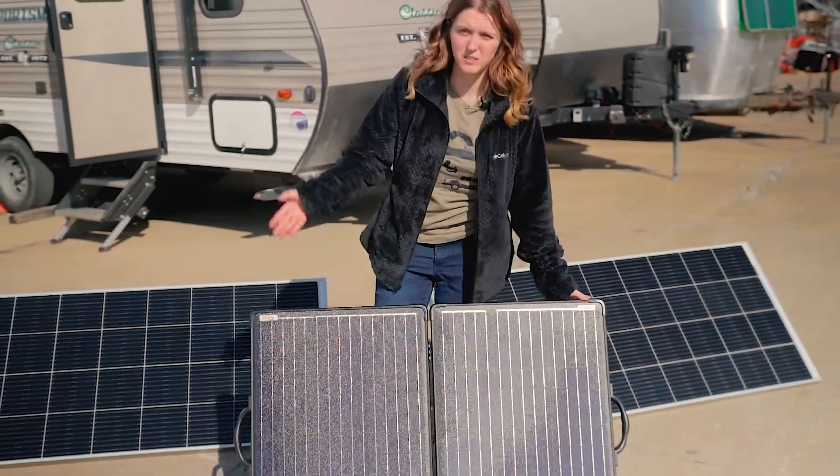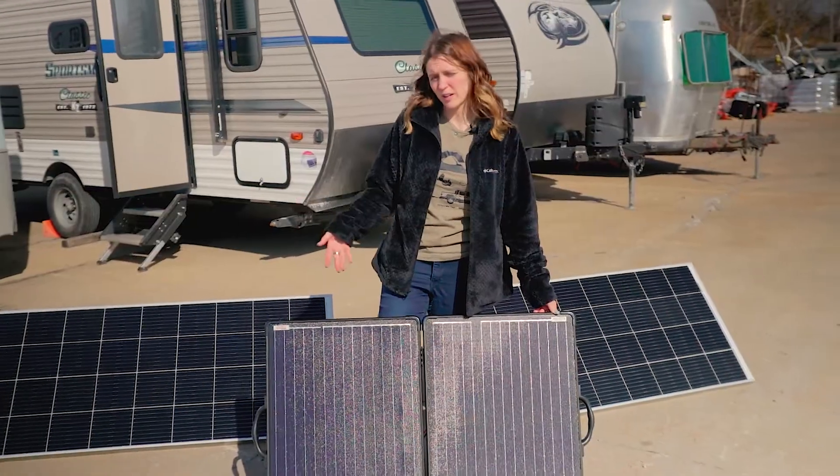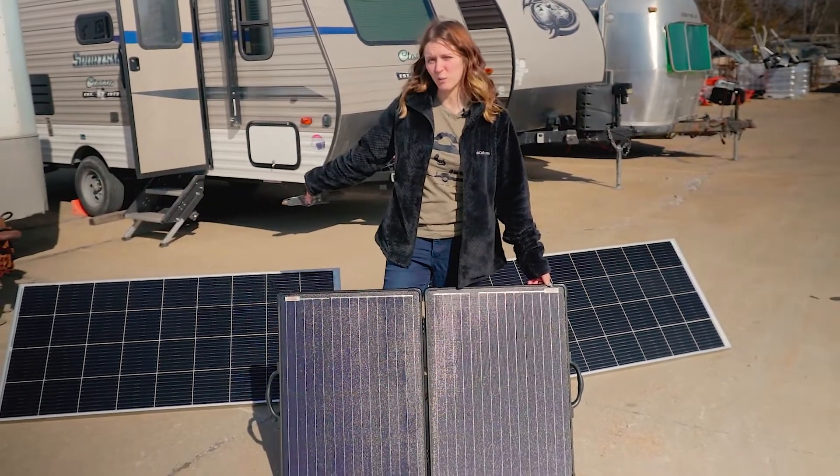Anywhere between 200 and 500 watts is going to get you that little bit of extra wiggle room. It's going to be a constant act of achieving balance between your panels, your batteries, and your appliance usage. If you want to use more appliances, you're going to need more batteries to run them, and you're going to need more solar panels bringing the energy in for those batteries. A portable panel is a really convenient way to add extra solar in addition to the panels on your roof.